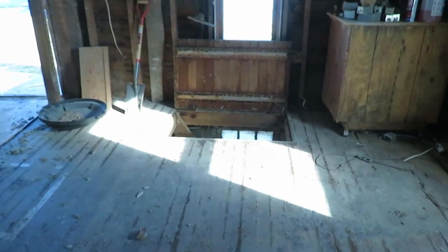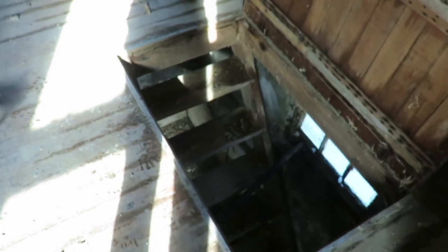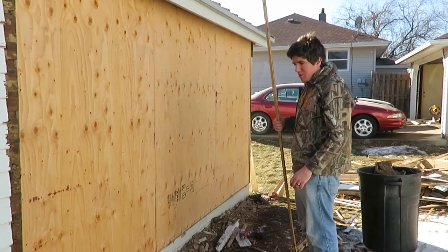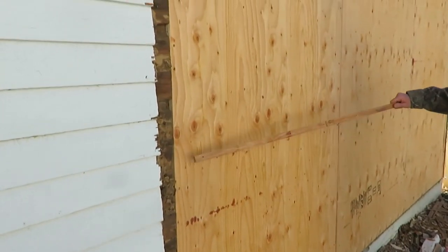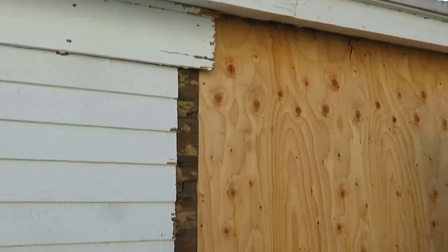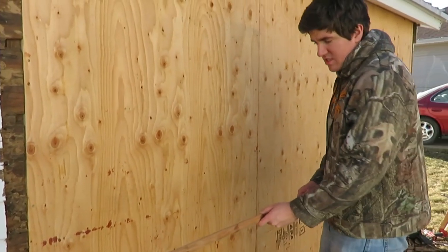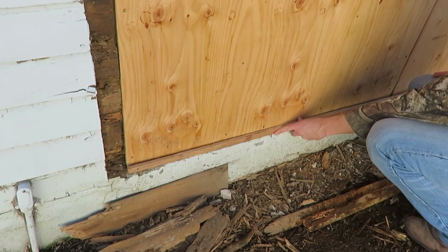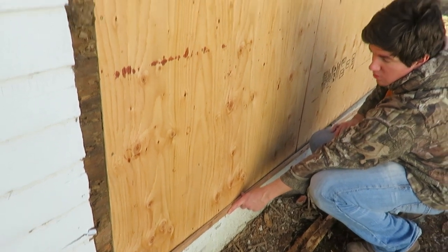And there's the basement — it's pretty creepy. That's how they did it back in the old days. So what I'm doing now is I've got to get this new siding on. You can see the old stuff here. My new siding will butt up against this. I'll clean this up before I put it over the top of it. I've got to get this siding to come out — it's flat normally, but you put in a little piece like this, just a strip of scrap wood, at the bottom. That starts your angle off on your siding so they match when people look at it. Then you start from the bottom and work your way up and it'll go real fast.